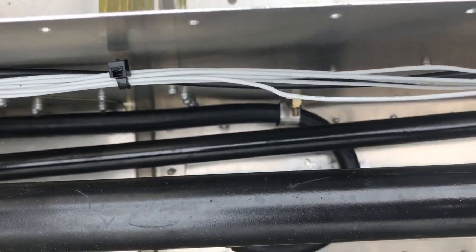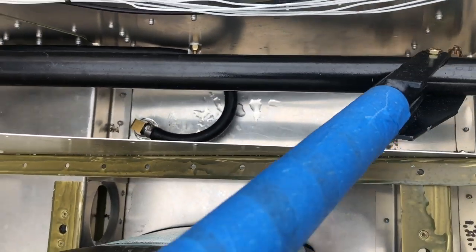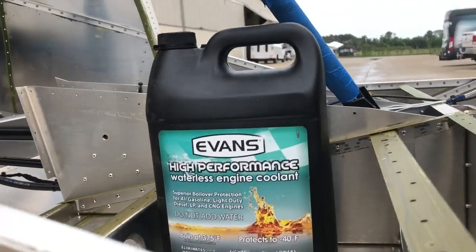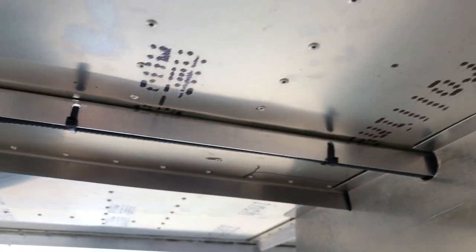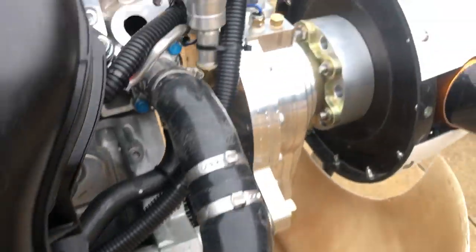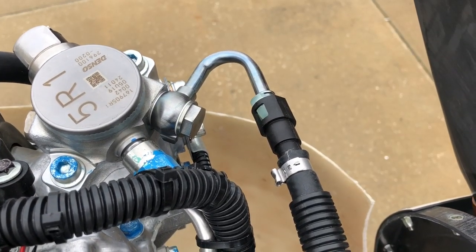More things are going into this area. We did a U-turn through in front of the landing gear to get past the landing gear mechanism of the control system. Then we came down just in front of the landing gear and went through the channel in the belly — we did this before mounting the radiator, so it's all going through there. Coming out along the nose wheel up front, use some ADEL clamps to clear the nose wheel, then run the hose up along the engine to the high-pressure pump on the engine. That completes the whole fuel system.